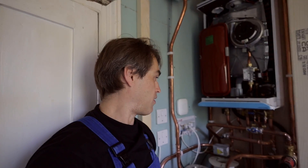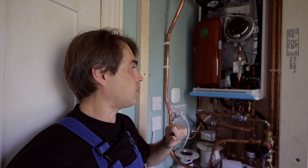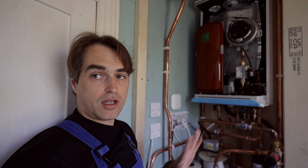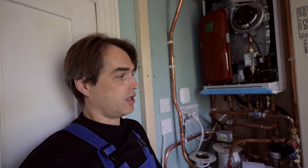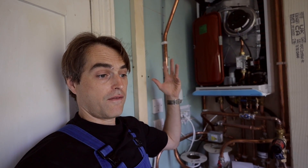In here I've got a boiler to wire up. What I'm doing here is a diverter valve — that valve is normally open to central heating. Nest is running on OpenTherm. Central heating is just one zone because this house, even with the loft conversion, is still under 100 square meters. When there is a call for heating, Nest fires the boiler on OpenTherm and the valve is in its resting position — not activated. Central heating works without any power going to any valves. When there is a call for hot water, the valve moves to open the flow to the cylinder and it blocks the heating, and then the boiler fires up on a predetermined kilowatt output and flow temperature.